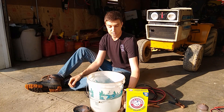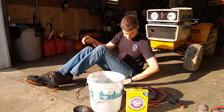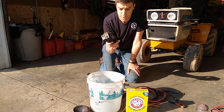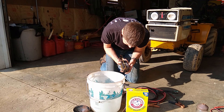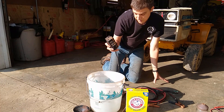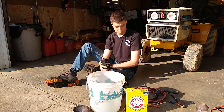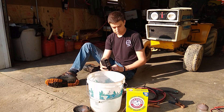The other component you need is a power source. What I've got are two AC adapters for laptops that run at 19 volts DC — so you're doing DC input here. I've run them in series, giving me a pack at 38 volts. You can run higher voltage and more current for larger work pieces. For this piece here we probably don't need that much, and it actually works better if it works slowly.